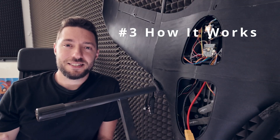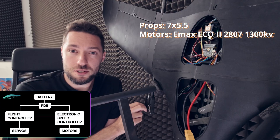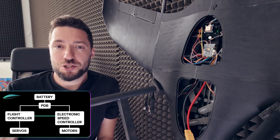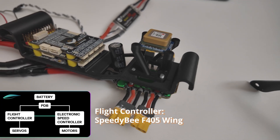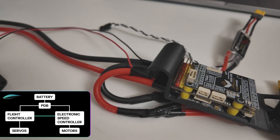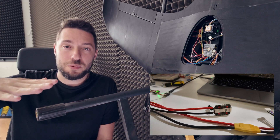Vertical takeoff and landing is achieved through these vertical propellers, exactly like a traditional quadcopter drone. Each of these propellers is powered by a motor. The motors are powered by a chip known as an electronic speed controller located here on the underside. This chip regulates the power sent to each motor, but that chip is controlled by the flight controller. The electronic speed controller pulls energy from the battery, but how much energy is pulled depends on the signals from the flight controller. The flight controller is essentially the brains of the system, acting to balance the motors in order to stabilize the drone.